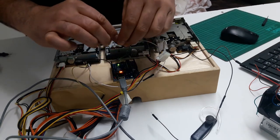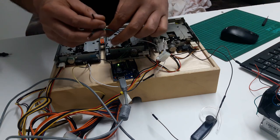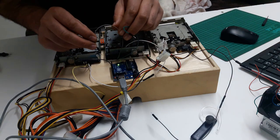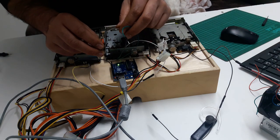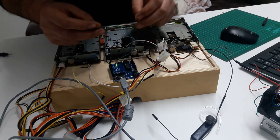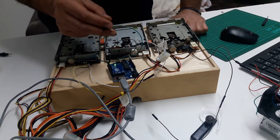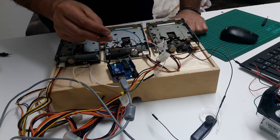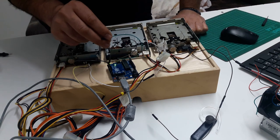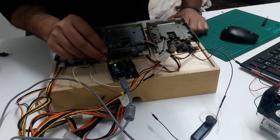So, as I said, always connect the pin 18 to any odd number, which could be 5, 7, 9, 11, whatever. Okay, I will take any random one, which is number 5 in this case. This is the pin 18, went to number 5. Now, if you want to connect the pin 20, you cannot put it in number 6 or anything like that. Okay, what you need to do is to connect the pin 20 to number 4 here. Okay?